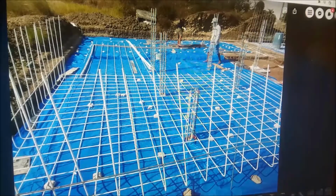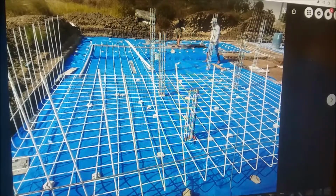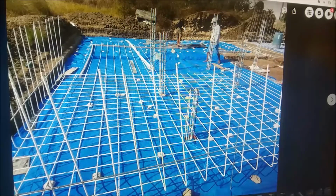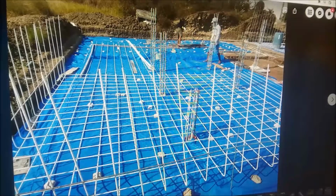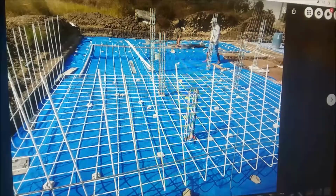Oh, you can see out here we got a notch board laid out, and the end notch is the last one that was not in a notch board on this first grid. So he can put a bar in every one of them notches down to the other end. He'll have another notch board over here someplace when he does it. And then you see one here. That's for the bottom bars. This end, all they have to do is tie it to the previous bars.